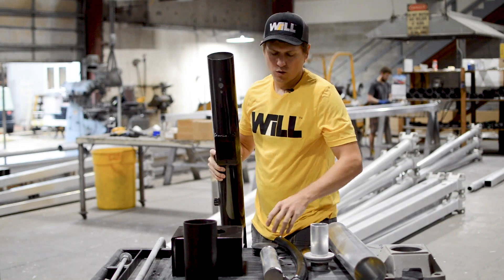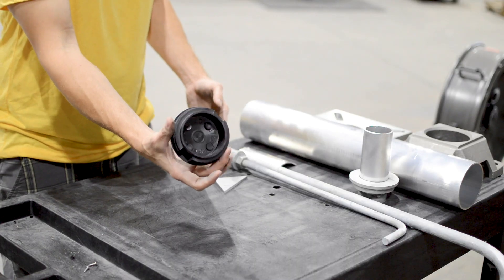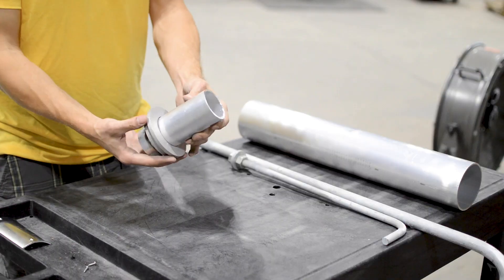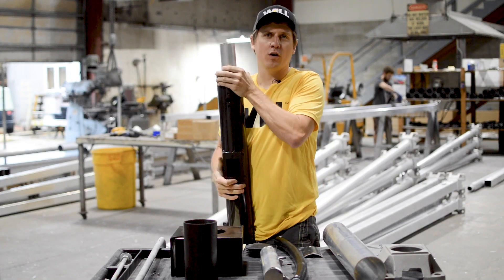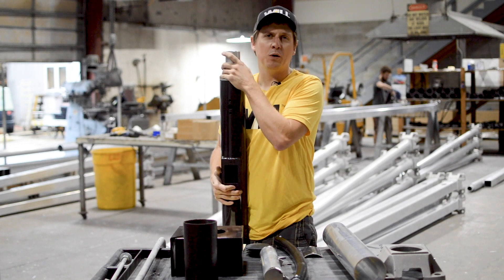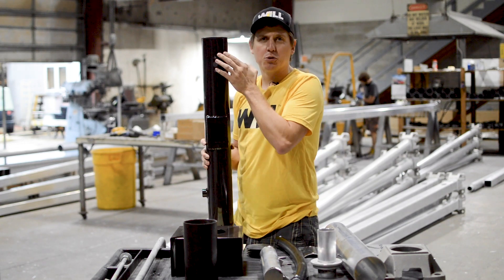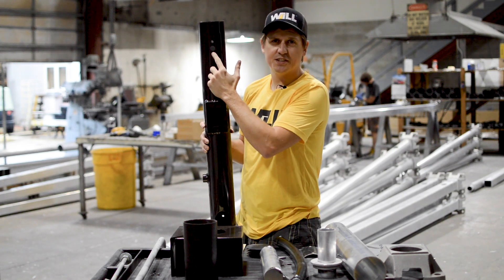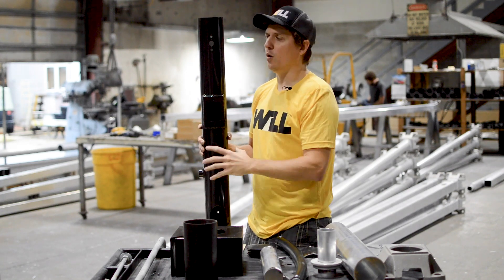The top of the pole is covered with a top cap — either a removable top cap or a tenon which is welded to the top of the pole — for fixture mounting or mounting different brackets. If the pole gets a top cap, it's drilled through and the fixture has an arm that bolts to the side of the pole.